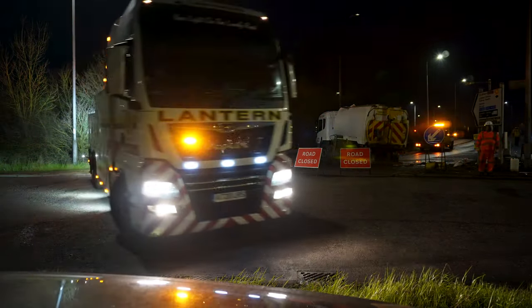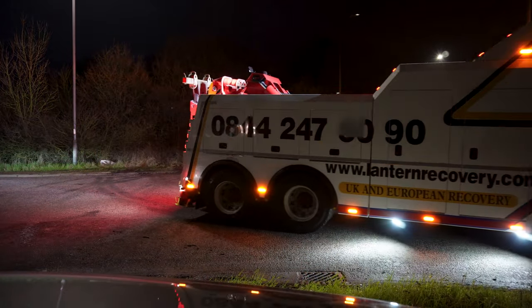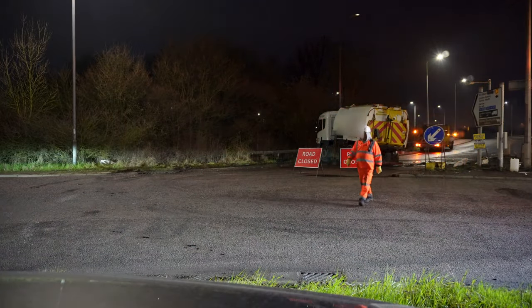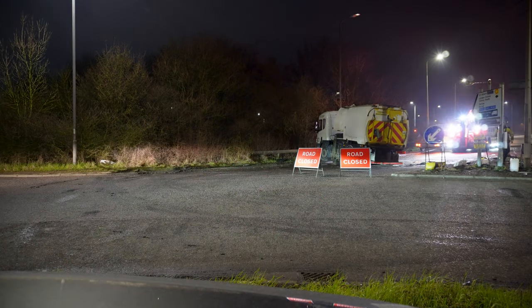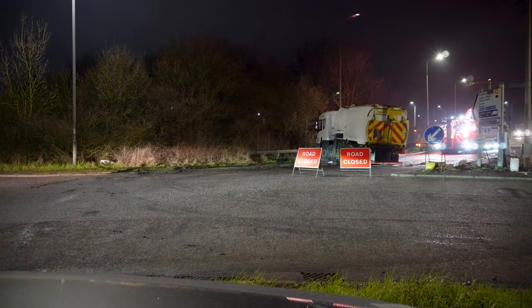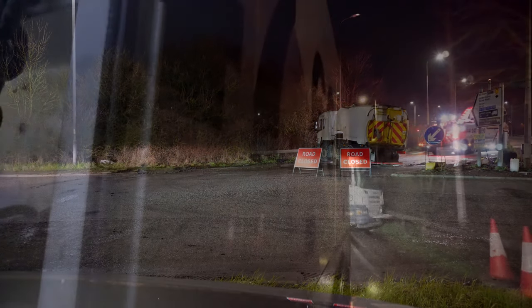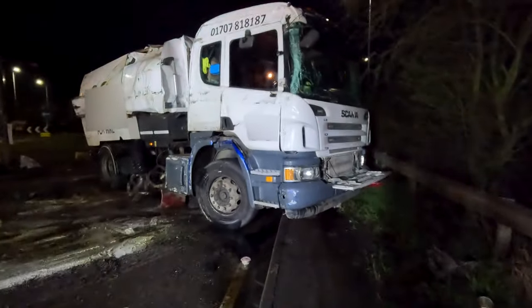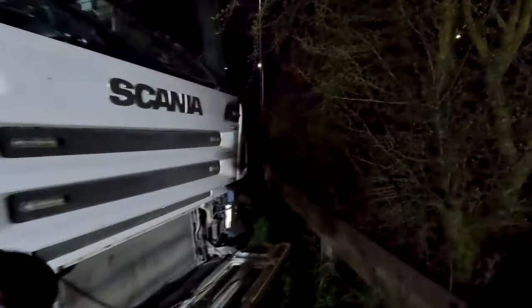It can be quite difficult as well. As the rollover goes on, you don't know what airlines have gone - you could have a good two hours of work yet ahead of you. It's not like a nice and simple lift and tow where you're always guaranteed: lift it, pedestals, forks, chains, airs, half-shaft lights and away you go. This thing's been flipped onto its side, so you don't know what damage has been done. Are airlines ripped out the front and centre? Will it even take air? Will it want to roll? Sometimes you can pop a tyre, pull a tyre off the bead and you've got a flat tyre when you roll something over.